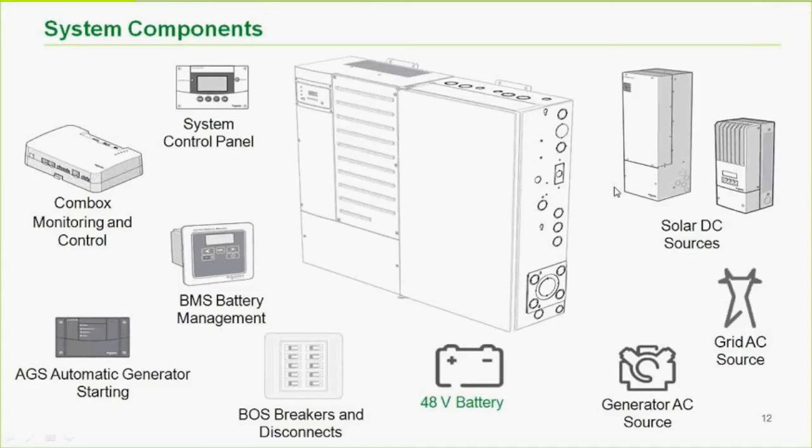But also, anytime you're using energy that has gone into the batteries and come back out again, in other words, non-daytime loads, so about 80% of the day, it's more efficient to go directly in via a charge controller, in my opinion. Though for daytime loads, you can say that the conversion from grid tie inverter straight to loads is very high efficiency, that's true, that's only for 4 or 5 hours a day. The rest of the time, it has to go to the batteries first.